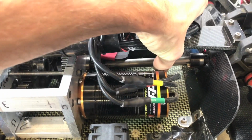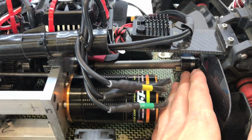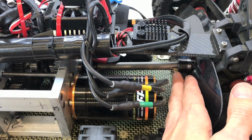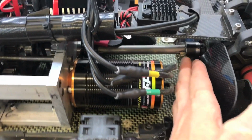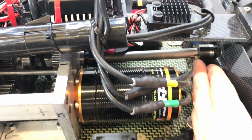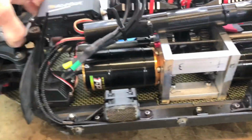But super strong, because I silver soldered. I used an angle grinder and cut a slot in the end of the tube, and inserted another bit of stainless steel. If you know anything about soldering, I silver soldered those little paddles on either side, and silver soldering is the strongest thing you're going to get, basically bar welding, so those solders are not going to fail in a hurry.